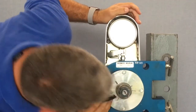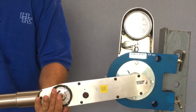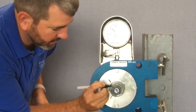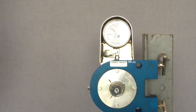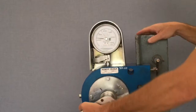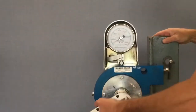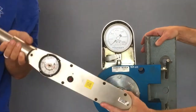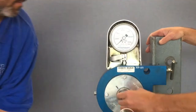It's very important to get this test done before the contractor starts installing bolts or begins erection of the steel beams. If the test is done after and the bolts fail, the contractor will have a real hard time going back to remove bolts or face the penalty. Make sure as soon as bolts arrive on site you get your test samples to the Division of Materials and your bolt assemblies together for the rotational capacity test. This could take a full day depending on how many bolt lengths and diameters you have, since you do two bolt assemblies per lot.